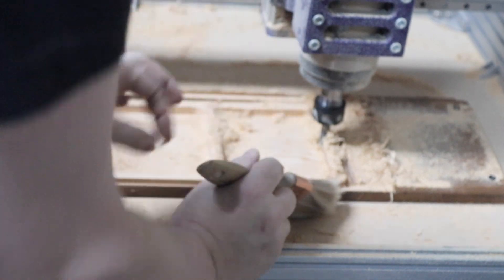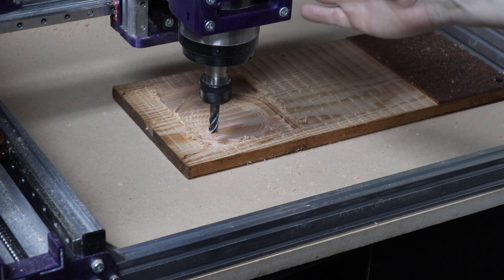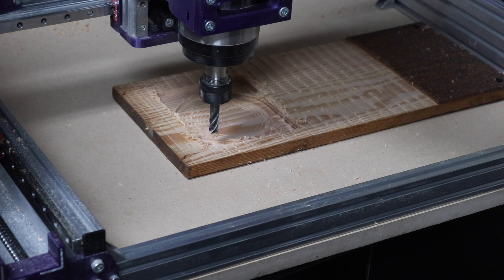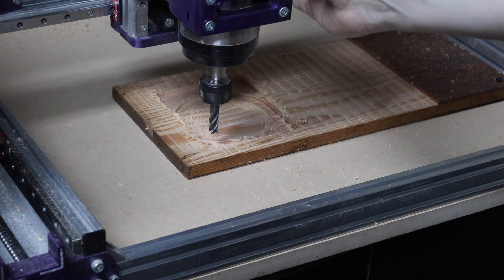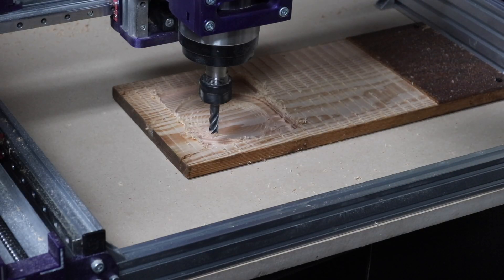That was mostly successful — it almost finished. While cutting, the spindle went down a little bit because I'd forgotten to turn on the water pump, so the motor got very warm. Since the mount is PLA — probably the most temperature-susceptible plastic — it loosened up and allowed the spindle to slip, so it started smoking. When I paused to let it cool and then hit resume, it missed some steps and cut into itself and into the MDF. I've tightened the bolts and have the water pump on now. Setting up again for another attempt.